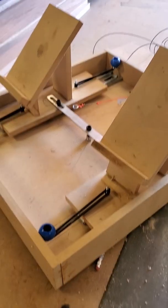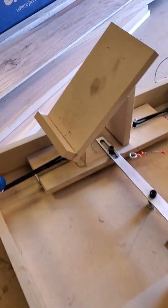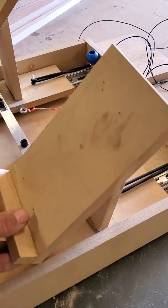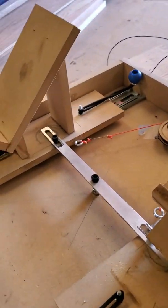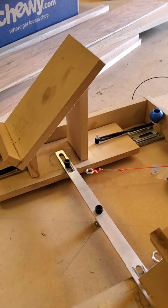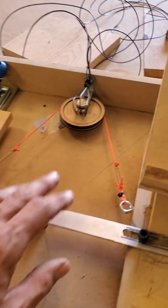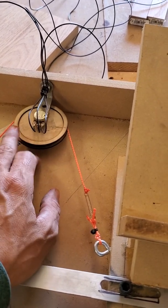This is my first update for the DIY pedal and yoke that I've built. The first update I'm doing is on the pedals because I ran into a critical design flaw: my pedals are only in a single plane, a single shear plane, and they folded completely over as I was using them. I'm also really unhappy with these drawer glides — the bearings are not riding in their races correctly — and I'm not happy with the wheel setup, as it's very easy for it to get off center.